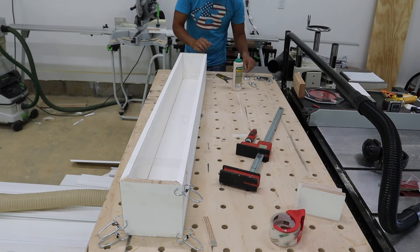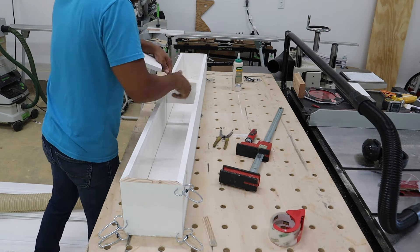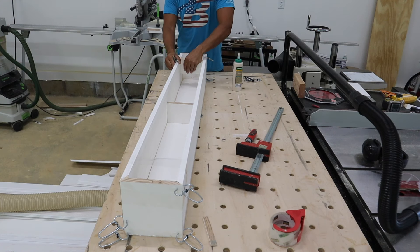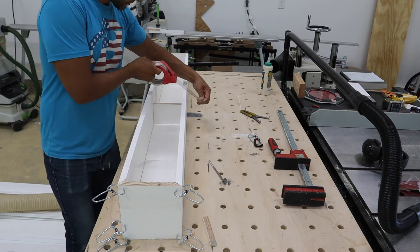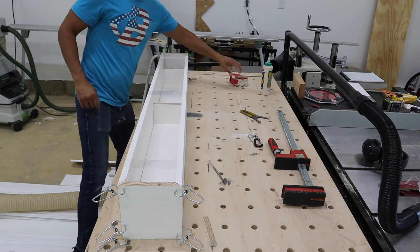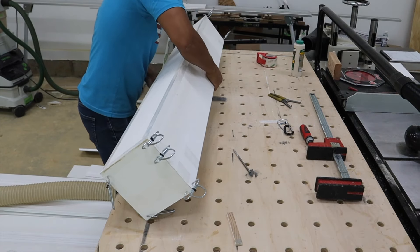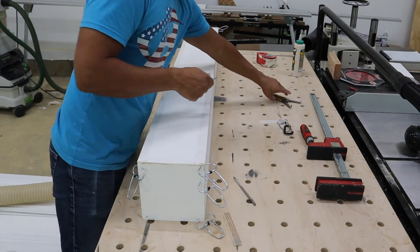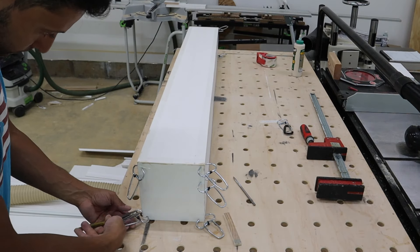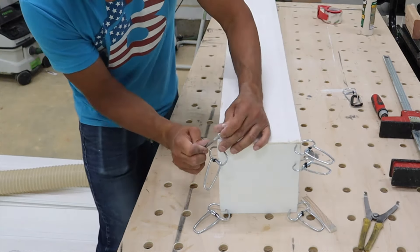For the end caps, I'm using miter spring clamps to hold them in place until the glue sets. Once I position the end caps and have the clamps installed and it sitting where I want, that's when I find it easiest to glue and slide in the spacer blocks. Once everything is positioned correctly, I use the packing tape as a clamp, pulling it right over the top from one side to the other with a lot of pressure — that acts as a clamp squeezing in the spacer block in the center. You don't need any expensive clamps; I just have a parallel clamp on the side in case I need to squeeze a joint more properly.